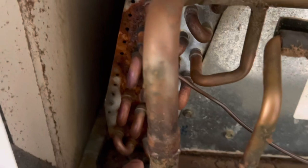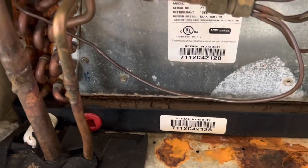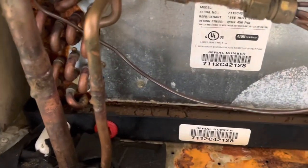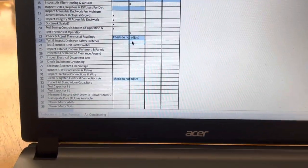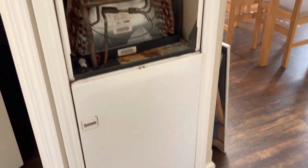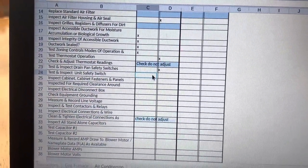Test and inspect the drain pan and safety switches. On a mobile home, there's a drain here going all the way down, and there are no safety switches — and there needs to be by code. I would put a safety switch somewhere on here, maybe in the pan or off the backup drain. We're going to put fail on that because there are no safety switches. Anytime you have an AC and below it is livable space, you have to have safety switches in case the water overflows — you don't want to ruin the floor, subfloor, or anything below.